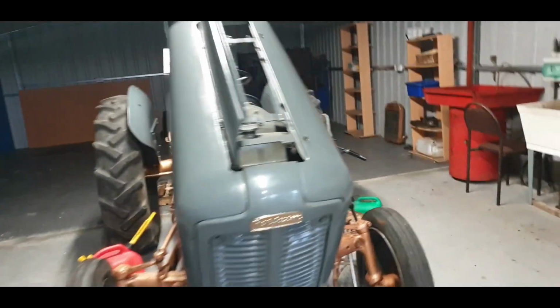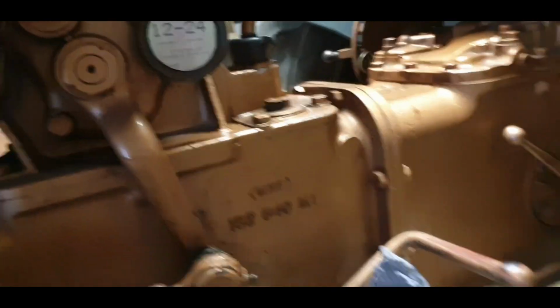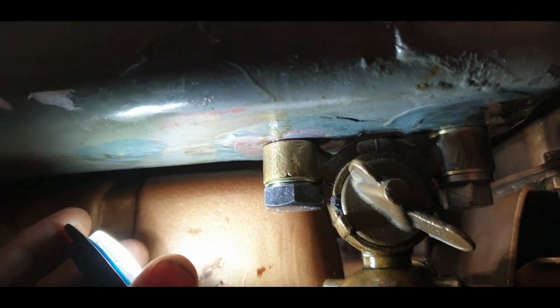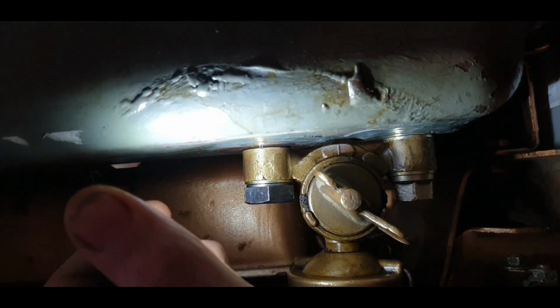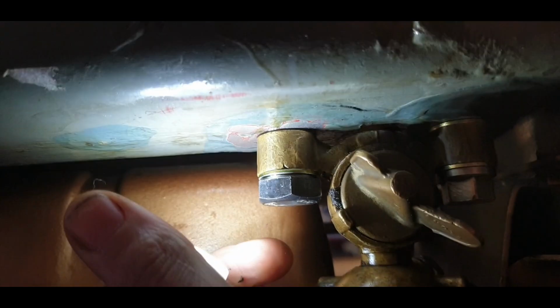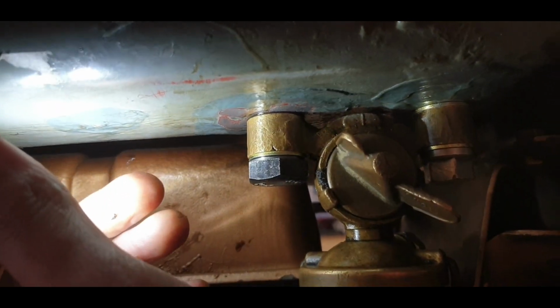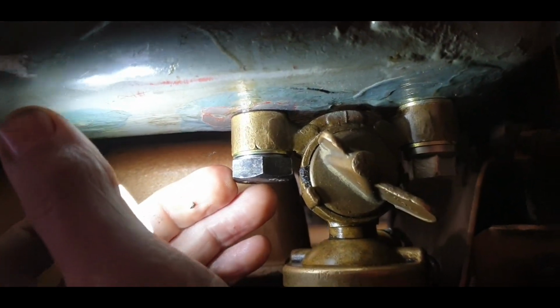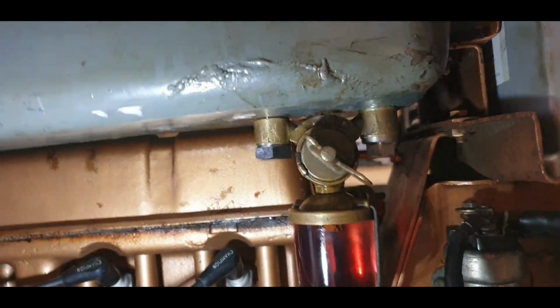So we're back again, and that last sealing washer was a kind of mix between rubber and plastic. It was still leaking, so I just wiped it half dry there, and even though I emptied most of the fuel out of this, you still have a bit in from where the banjo bolt is going up through it, so it'll be a bit of a mess again, and that's unavoidable. I don't mind that. So I'm going to take that out, because the last few evenings I left it, well, 24 hours or so, tightened up and checked again each next day, and it was always kind of running down along there and starting to drip very slowly and all of that, but still it's just something I want to get sorted.